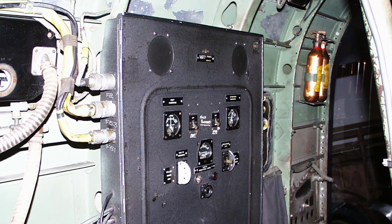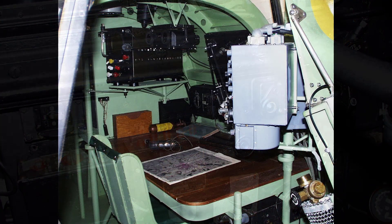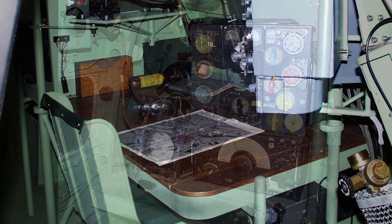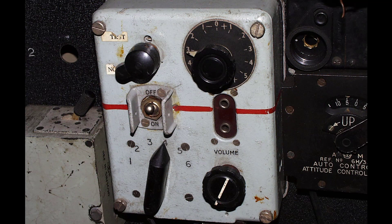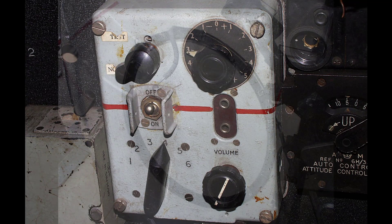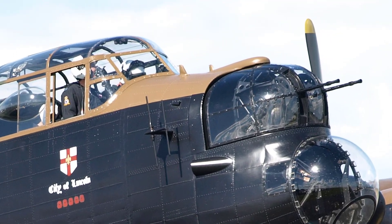An electrical services panel and an auxiliary fuse panel are fitted on the starboard side of the fuselage just forward of the front spar, carrying the fuses and charging instruments. The radio equipment consists of a TR9F or TR1196 set remotely controlled by the pilot, a TR1335 set at the navigator station, and Transmitter 1154 and Receiver 1155 at the wireless operator station. The beam approach R3003 or R3090 and T3135 and R3136 equipment is also installed. Hand operated de-icing equipment is installed for the air bomber's window and the pilot's windscreen.